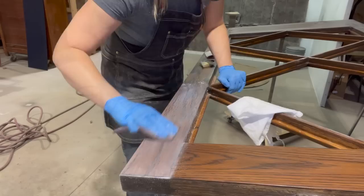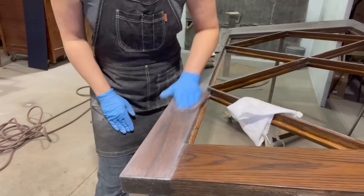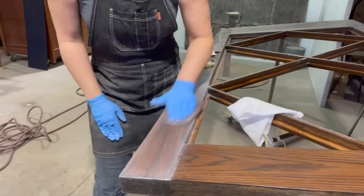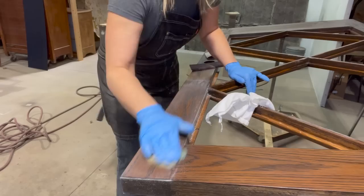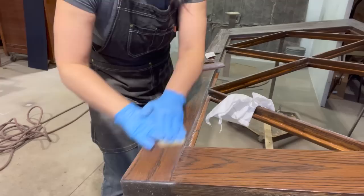And then just really straighten out the scratches, which is what buffing is basically, not polishing. It's just creating scratches in one direction, usually with the grain, so that the light doesn't reflect in 17 different areas. Just in one direction, and you get that nice soft satin sheen. About that much. Then I'll wipe that off and take my white scotch pad, mind the edge again. And that's just going to refine those scratches, and then buff it out with a nice cloth.